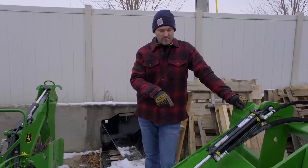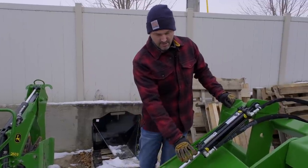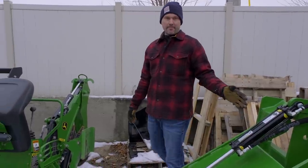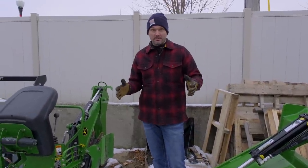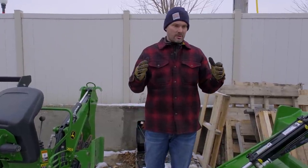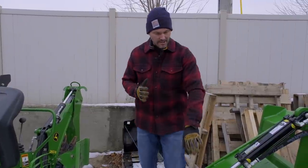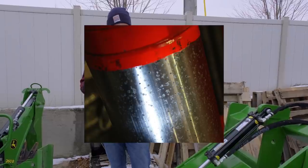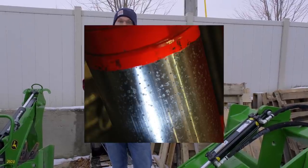Problem of the day: what do you do when you have a cylinder exposed like this for a long period of time? Could be on a backhoe, you've got the grapple here, could be your bucket, could be an extra attachment that has a hydraulic cylinder on it. A lot of comments in videos talk about retracting those cylinders — don't let these rods be exposed for long periods of time or you're going to have pitting, corrosion, problems down the road, expensive repairs.